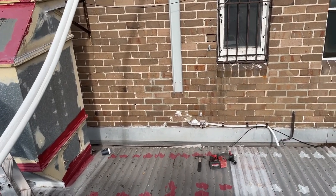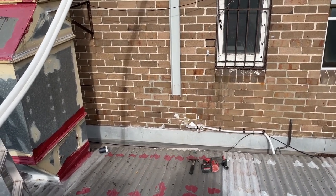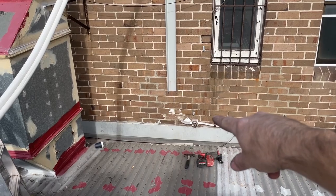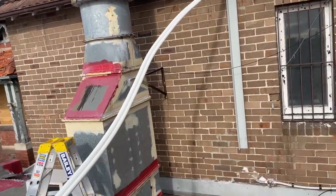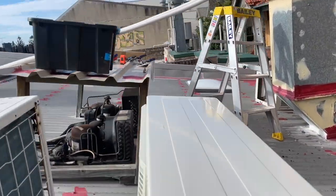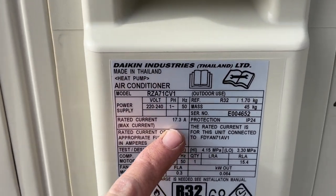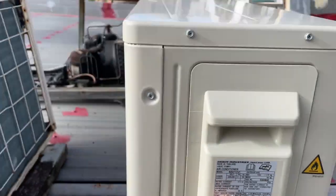I wanted it as a 20 amp designated circuit. I don't know if they can do that. I have no idea what's going on. But 100%, when I walked up here, that J-box just there didn't even have a cap on it. It was just out in the weather. Absolute red hot. But anyway, this is a max current of 17.3 amps. Should have 20 amp single phase